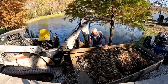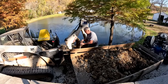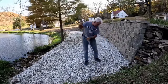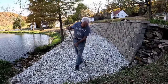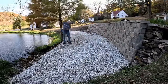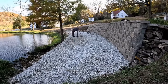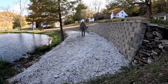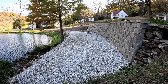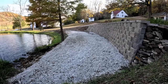I think that's going to be good enough. I think I can push the rest of it out, smooth it out, and cover it with gravel — we'll be fine. That's going to be it for right now. Tomorrow I'll get the laser level out and shoot a grade on all this and try to get it all real level. And then we'll start building forms.